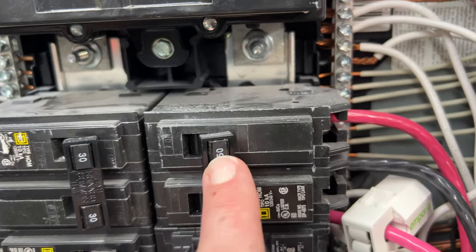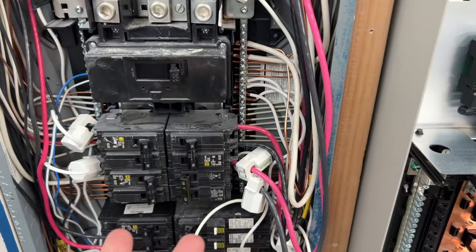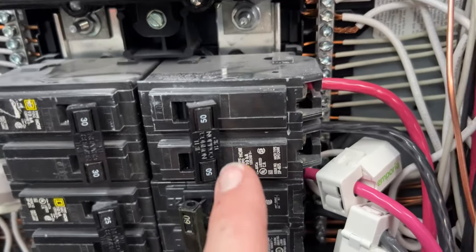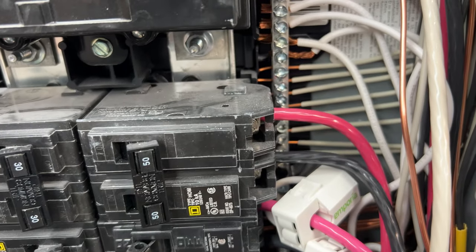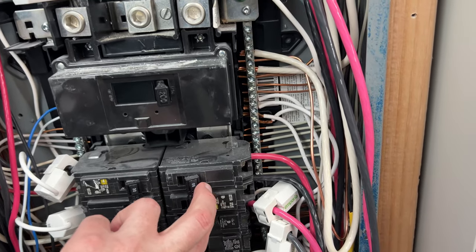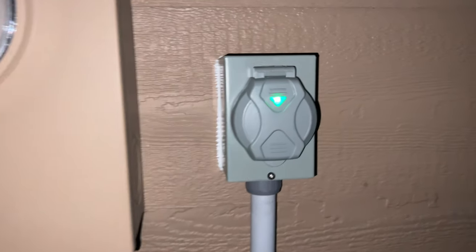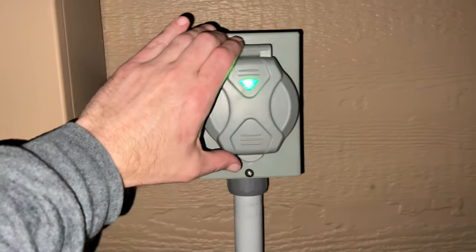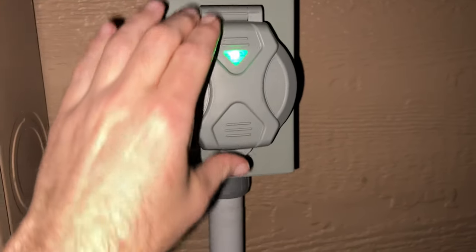I haven't got that 60-amp swapped out yet, but I did get this rewired to the new 6/4 wire that I just ran. I think everything is good to go — red, black, everything looks ready. Got it ran up through there. The way the generator thing works is that if it has power, the little thing outside will turn green. So I'm going to flip this on — one, make sure it doesn't explode, and two, I'm going to go see if the light's on. Let's go check it outside. Here we go. You can see it there — it's green, lit up. That means it has power.